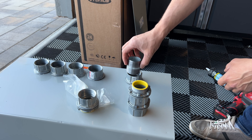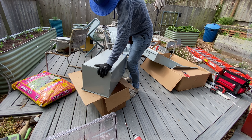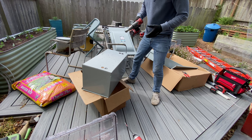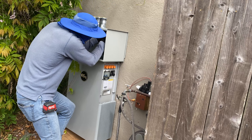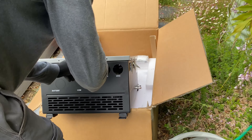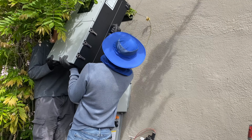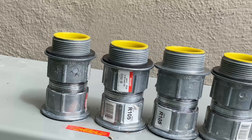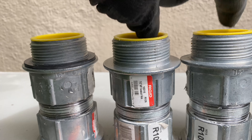The Solark bottom clearance should be 6 inches for cooling, and I'm going to use conduit hubs and close nipples so we're going to get about 6 inch distance between the wireway and Solark. The first attempt to install the Solark failed because the distance between knockouts was too close — the conduit hubs were hitting each other and not allowing it to sit properly.